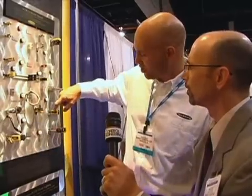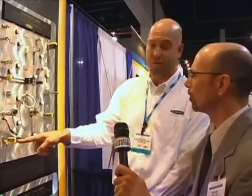Some of these do have a teach mode as well — you have push buttons on the back. We've standardized on a push button teach procedure for all of our products, so it's consistent across all product lines for ease of use. Most of these are a single push button where you either teach the target or teach the background, and it sets itself up based on that single condition. Part of the idea of the WorldBeam sensor line is to address about 80% of all applications — basically taking a catalog that's an inch thick and narrowing it down to a couple pages of proven technology that works. So that means a lot less in the stock room. There are also some specialty sensors within this line — this particular one actually senses the presence of water, using a high-frequency infrared light source to detect water in clear bottles. So there are some unique solutions built into this family as well, but for the most part, this is going to be the place to start.